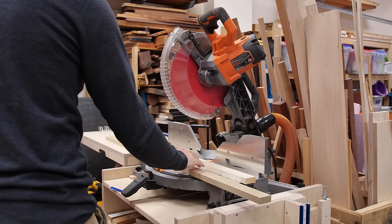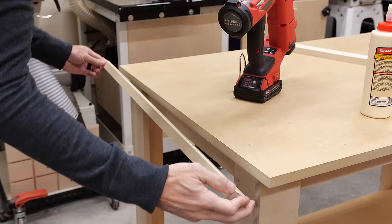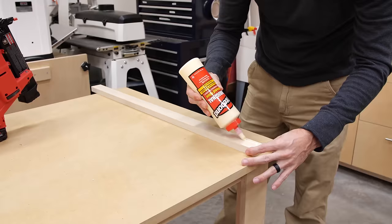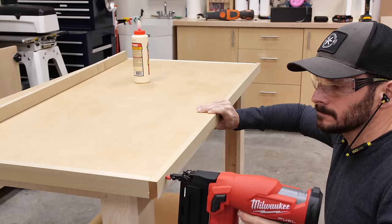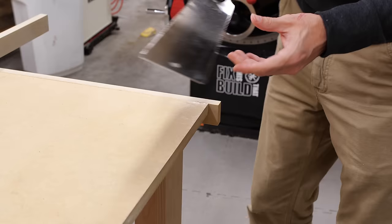With the top on I brought over the poplar trim. I started the short sides, set one end flush and made a mark about an inch long on the other end, then cut the piece to size on the miter saw. I'm just using glue and brad nails to attach the trim. If it were regular plywood I probably would have used pocket screws on the underside and attached the trim before installing the top, but MDF doesn't hold screws very well so I defaulted to a glue-only connection held in place to dry with brad nails. After securing the short parts flush on one side I installed the long trim on that same side. When attaching the trim, err on the slightly proud side so you can sand it flush down to the top at the end.